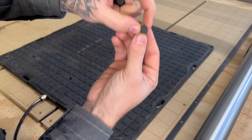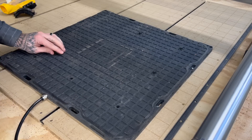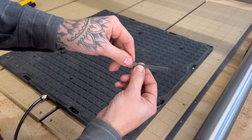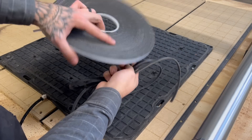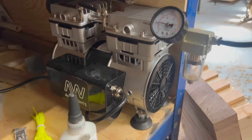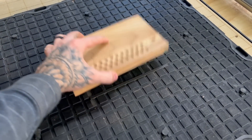Let's briefly go over how this works. There are all these holes in the bed and you plug the ones you're not using with little rubber corks — that stops airflow from sucking through those areas so you don't lose pressure. Then there's a foam strip, about a quarter inch, that helps seal the bottom of the piece so you don't lose suction. I have the whole board blocked off except the little square inside the gaskets. You check the pressure gauge to confirm full suction — under 25 seems to be about full pressure. If you pull out one of the corks, you obviously lose pressure and the piece just comes off.